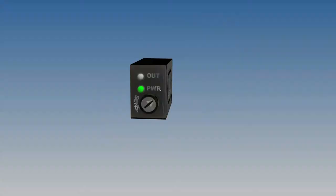On the side of the PhotoEye, there are two lights and an adjustment screw. The adjustment screw controls the sensitivity of the PhotoEye's infrared receiver, which determines the effective range at which the PhotoEye can detect a bale.